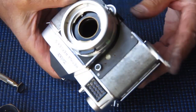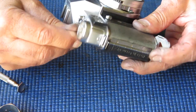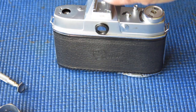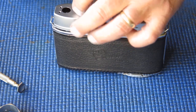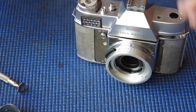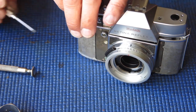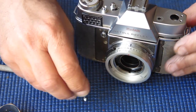it away. Well, that's immediately my film advance lever locks out at the full position. I've got a pretty good idea what's doing that. Let's get this top off. That is almost certainly the adjustment screw on the top of the release lever shaft, and almost certainly it needs to be screwed down another couple of turns.